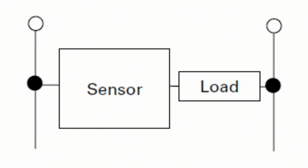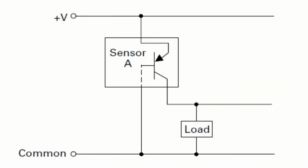So you have what we call a residual current, and that just means that the circuit in an inductive sensor application will always be drawing a small amount of current, whereas in the case of the limit switch in that 2-wire circuit, the circuit's open and it's not drawing any current when the circuit's off. Then there's another graphic you guys can pull up that shows a 3-wire circuit. So that was 2-wire, limit switch kind of wiring.